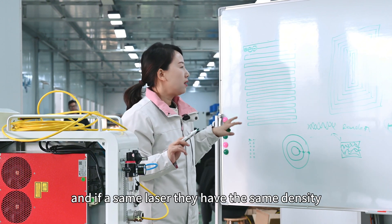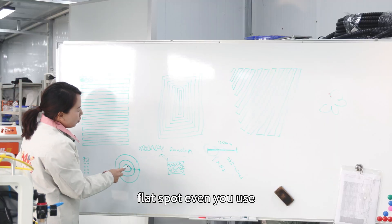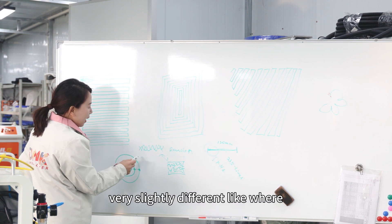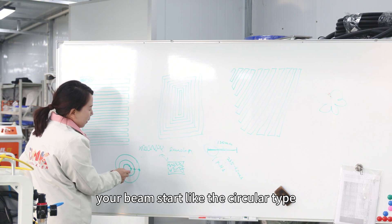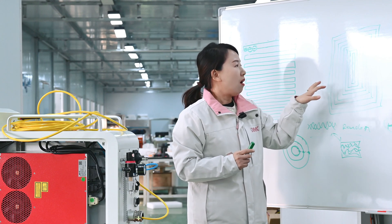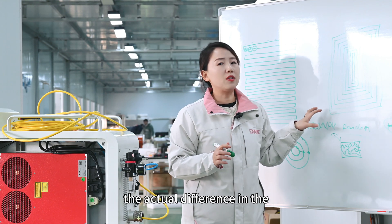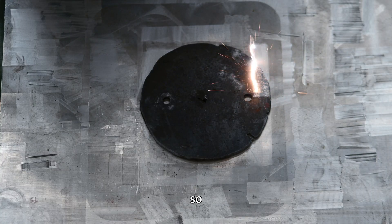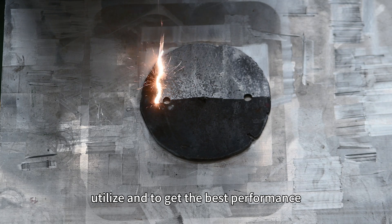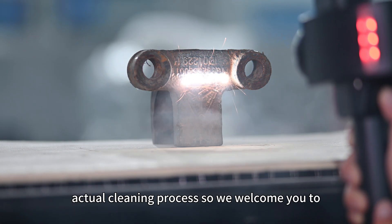Even with the same beam density and flat spot, if shapes look similar but are not exactly the same — very slight differences like where the laser beam starts or ends in a circular pattern — these differences are not easy to catch with your eyes because it is high speed and all shapes are moving in fractions of a second. But they create actual differences in the cleaning on the surface of your material. We are trying to explain that there are many factors in design and machine building that we try to utilize to get the best performance, but the effects still vary quite a bit in the actual cleaning process.